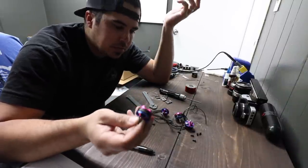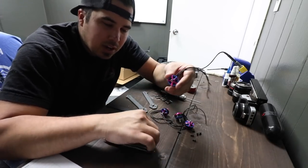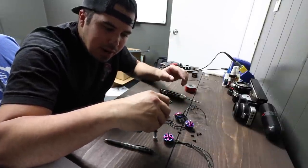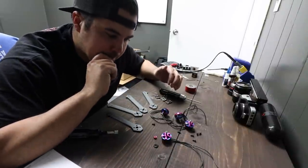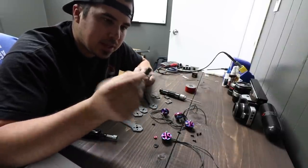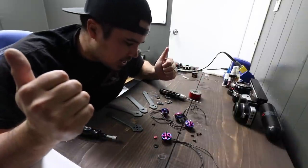I'm going to put on these motors - these are the ones from Surge over at PyroFlip. The only thing I don't like is that in the box you get a regular lock nut. I prefer a flange lock nut, but since this is a short shaft you'd need the low-profile version, which can have trouble getting a good grab with the tool. I'd still rather use a low-pro flange nut though. Other than that, these motors look awesome. I'm also going to be using TVS 25-amp ESCs like I've been using on everything - they're perfect for six-inch because there's no limiter and you can push the quad quite easily.